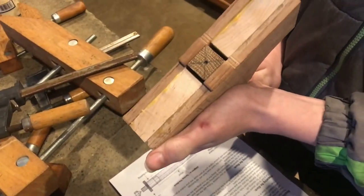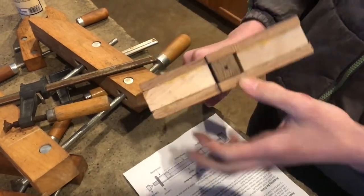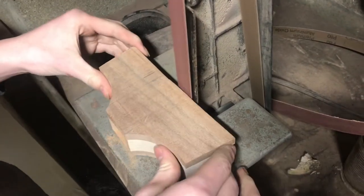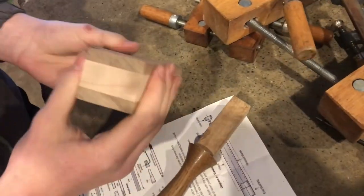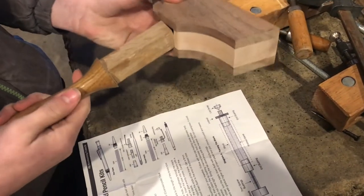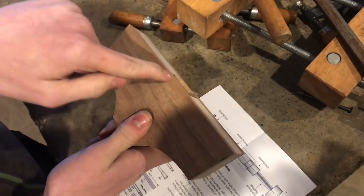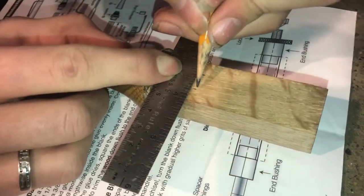That's perfect. It doesn't wobble back and forth almost at all. There's a tiny bit of slop but that'll basically go away totally whenever we put those wedges in. Now we'll clean this up on the spindle sander. With all the edges cleaned up this looks really nice, especially whenever I put the handle in — it fits in there just right. The gaps here are even and the lines are parallel, which means I got this surface flat. I'm going to cut both of these slits at 5/16ths.